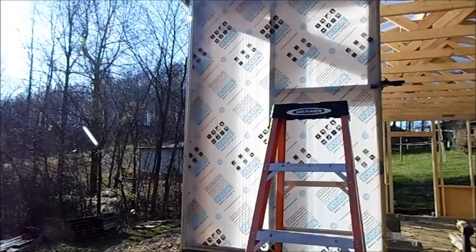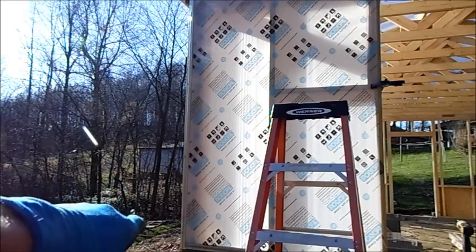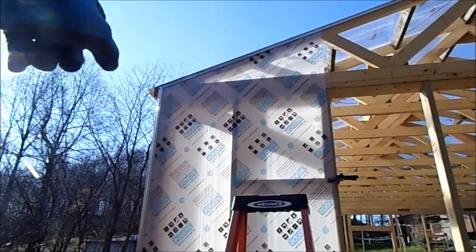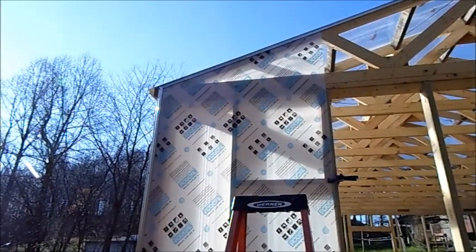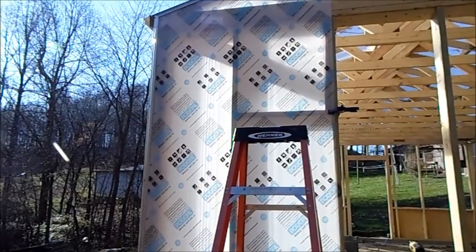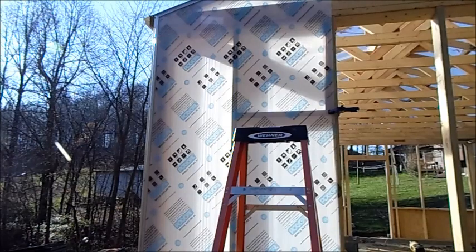Okay, now what I've done here, I went ahead and installed the piece of single H trim up the corner and then also up the slope all the way to the peak and cut the first sheet. And I didn't want to waste your time doing that, showing you that again. Same technique with the cutoff guide. It's just on a slope. So 4 foot wide, it's a four inch slope, 4/12 pitch, then you come over 4 feet, you go up 16 inches. So that's nothing complicated there.